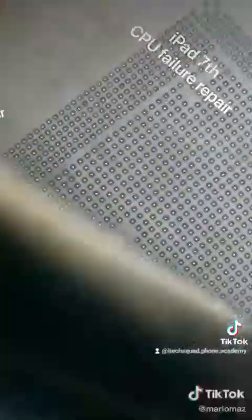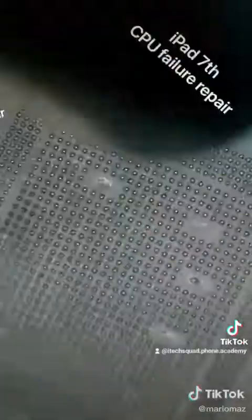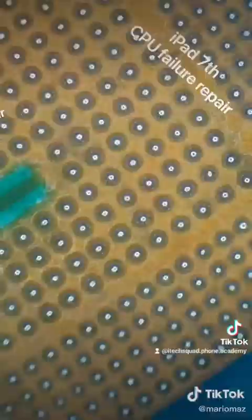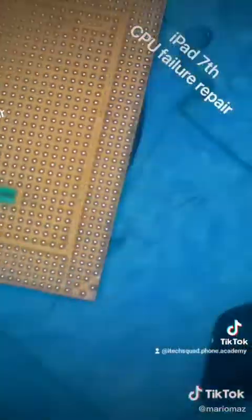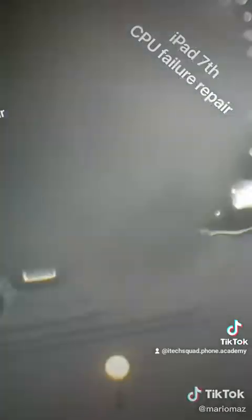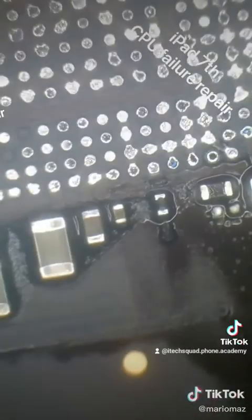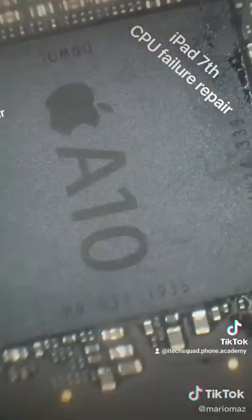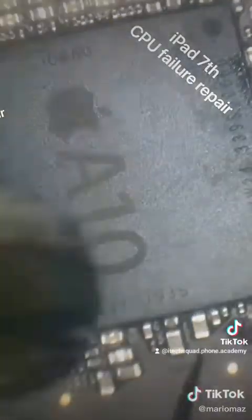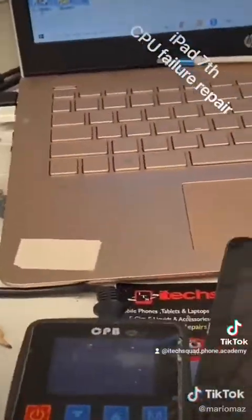Get all the balls nicely done — once they're all formed into nice little balls, we'll put the flux on and make sure everything's where it should be. Get rid of any loose debris, then put the little components back on the board — the two capacitors and one resistor. Then a light dousing of flux and we'll sink that CPU back onto the board. When we try to refresh it, jobs are golden.